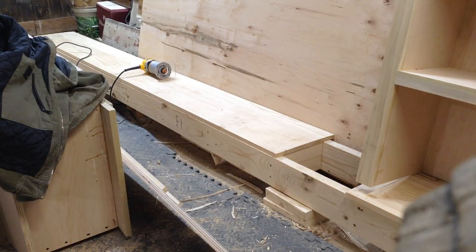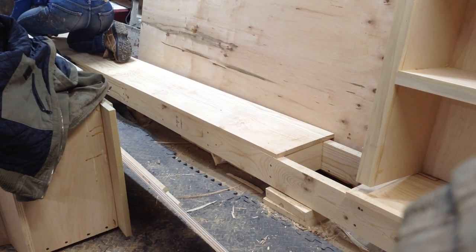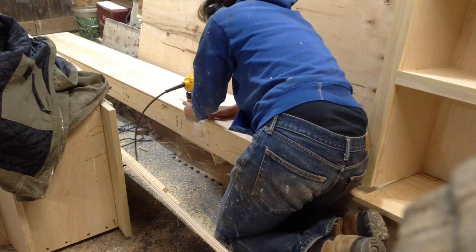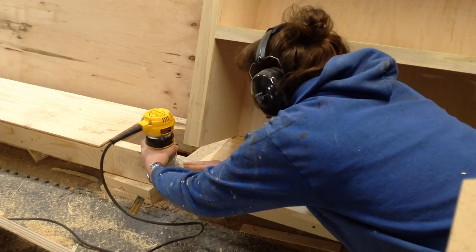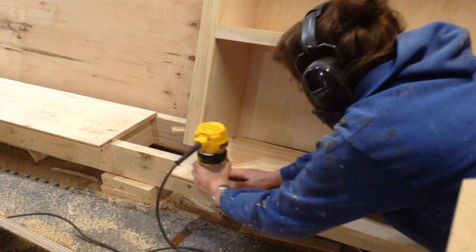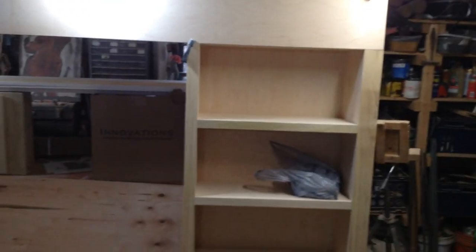So while I had that big bookcase off, I went through and I put a groove on what is going to be the rustic panel underneath the bookshelf and on top of the shelves. This is now a quarter inch bit, because the plywood I bought for this is quarter inch ply — it's almost perfect. So I could use that quarter inch bit and then use the plywood I have for splines. The stuff I used before was a little bit thinner. So I'm just putting a spline in the front edge of this, because there's going to be a piece attached to it, so it will look like one consecutive piece. I clamped everything back into place. Now I'm going to start making the panel covers for all of this stuff.